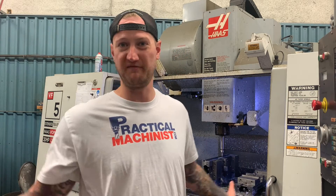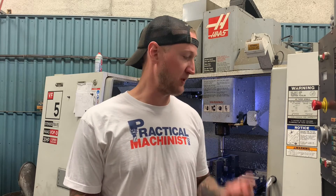They've been doing this the same way for decades and I don't see it changing anytime soon. It's nice if you have a probe, but some shops like mine don't have probing systems, so this is the way we've got to do things. The one biggest mistake I always see people make when they're first starting out is forgetting to jog half the diameter of the tip over after you pick it up. Remember: if you pick it up and don't jog half the diameter of that tip over, you're going to be off by half of whatever the diameter of that tip is. You always need to jog half the diameter over, so you're actually under the center of the spindle.